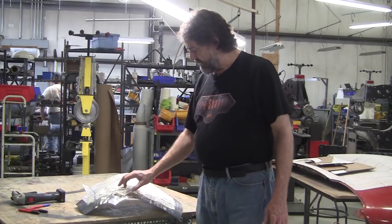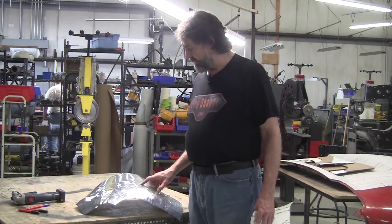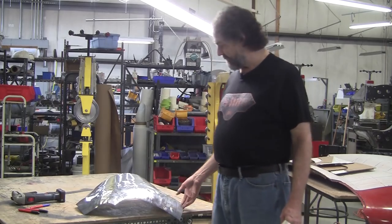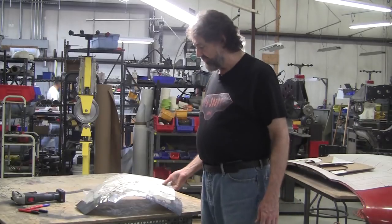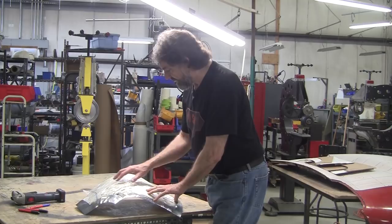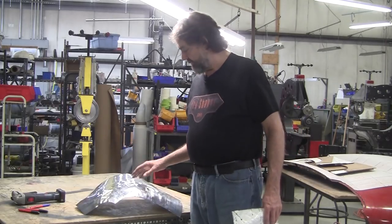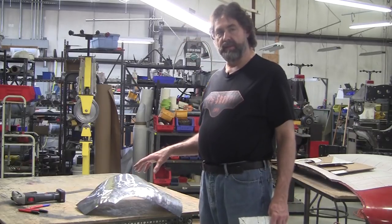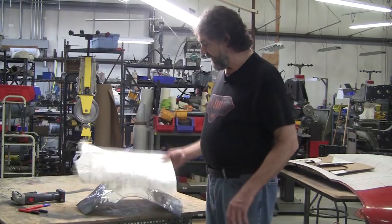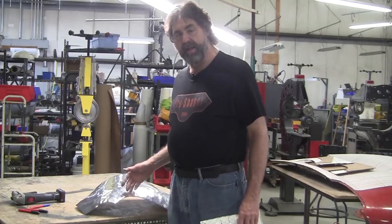In part three I started the process, and to get to this stage with my gathering tool and stretching here is about a half-hour job — not a major component of making this one part. After a half hour, you have it fitting the flexible shape pattern quite well, with about maybe a half inch of gap. What we're doing in this video is refining the shape. Refining the shape is the second step in my class program — the first step is doing the gross development of the shape.